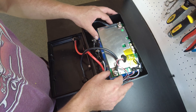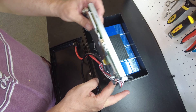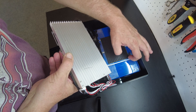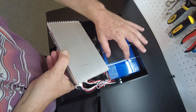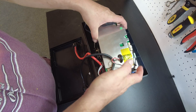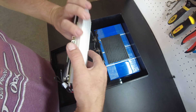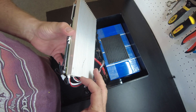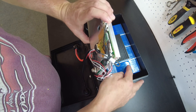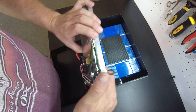Now, it wasn't perfect. There were definitely a few things I didn't quite like. One of them is this BMS mounting. It's only mounted with double-sided tape. There is a fiberboard in between — it seems like there are two pieces of double-sided tape with a fiberboard sandwiched in between. I feel like if you had enough bouncing or jarring action, this BMS may come dislodged. The other thing is that this pad doesn't cover the whole BMS, so if it did come dislodged, it might jam into the sides of the cells and penetrate the heat shrink wrap and maybe short out on the cells.